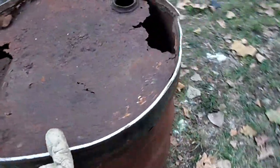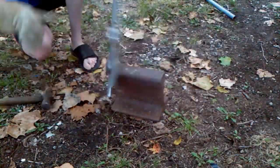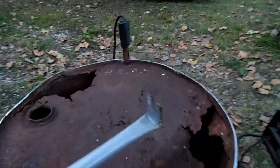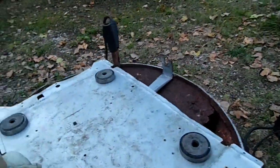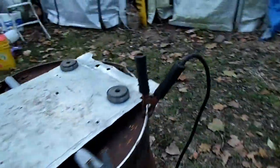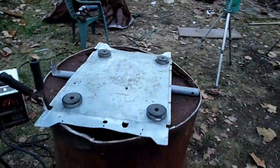Well, that was easy and quick to grind that off. Now let's flatten this piece of metal. So I have that piece of sheet metal flattened and I also bent it so it would fit inside there. Ground it a little bit — that'll be nice. Once I'm done welding this I'll just bend this over the edge, and this will fit over that. I can tack it on all sides, and then tack it to the insides. I believe that should be pretty good.